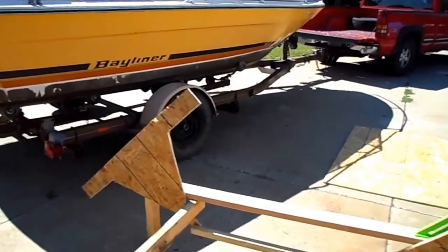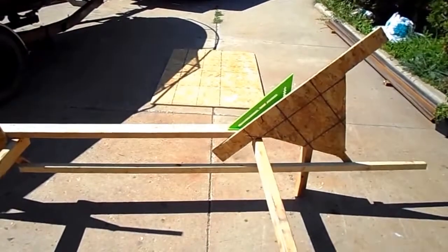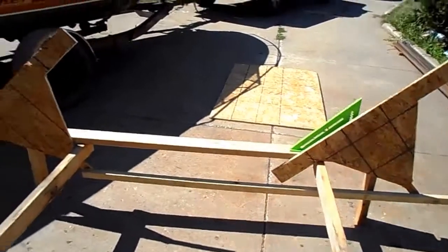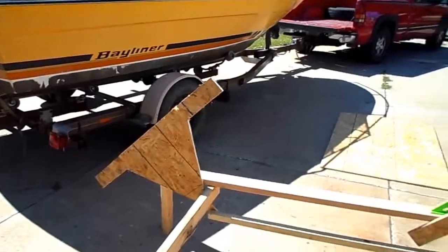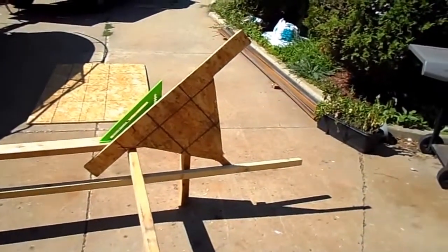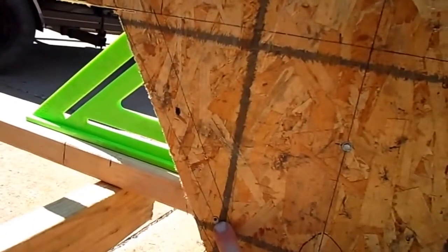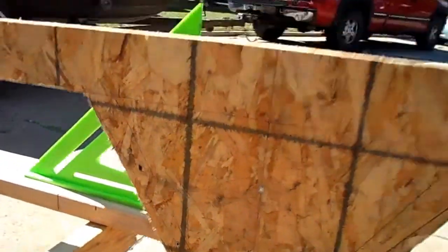The problem with that is the top of the east panel here will be blocking the sun on the west panel in the morning. Well, how do you get around that? It'd be nice if, when it turns, this east panel could drop and this west panel could rise. So I'm going to change the pivot point from the center to the inside of each panel bracket, and I'll show you what happens.